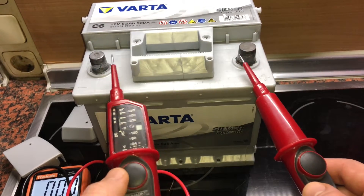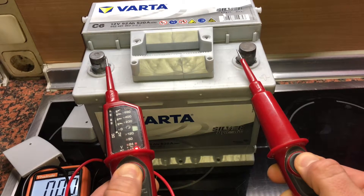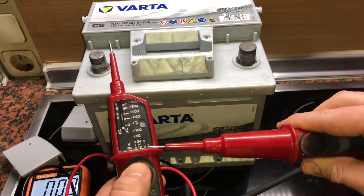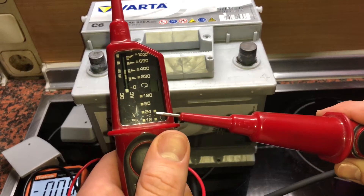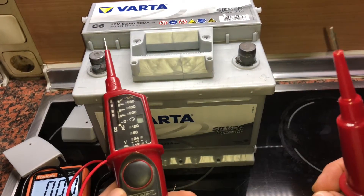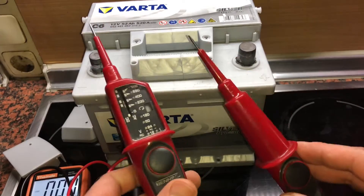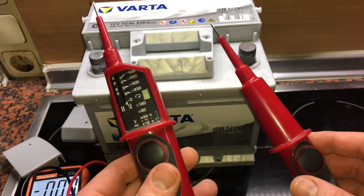Take both handles — L1 and L2 are equipped with push buttons. Activate both push buttons to switch to a lower internal resistance. We will use this option for testing DC voltage on the two poles of a car battery. Place the two indicator needles on top of your battery.